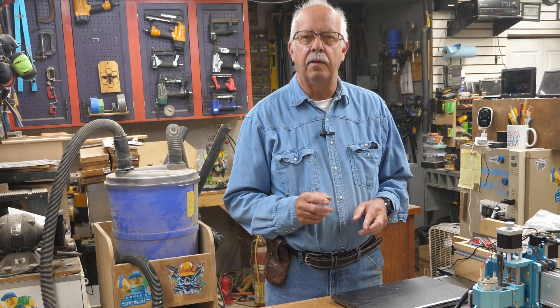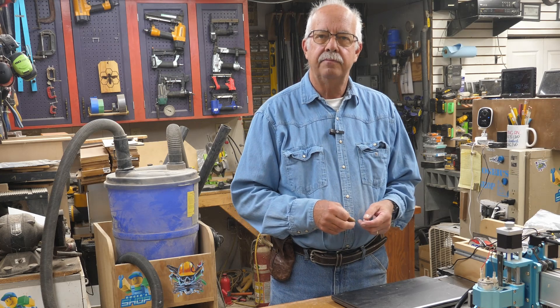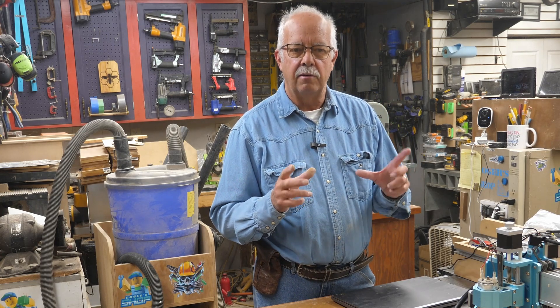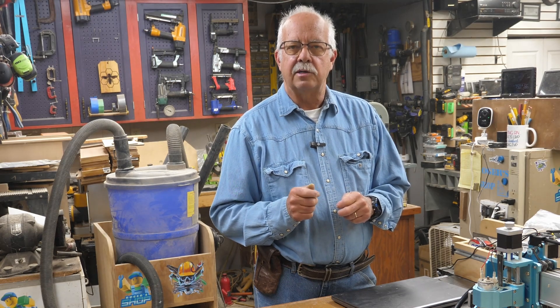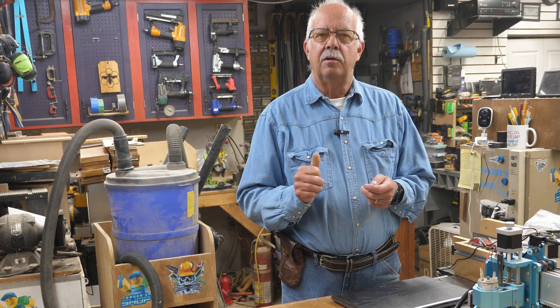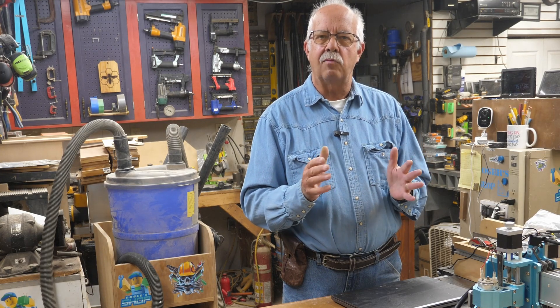Let's talk about time between the three. On the laser, I cut all the back pieces and each one took four minutes. The front with the laser — quarter-inch plywood — that entire cut took 12 minutes. On the scroll saw the front plate took about 30 minutes, and I probably should have taken my time a little more. On the CNC, it took two hours. So the CNC is obviously going to take the longest, the laser is going to be the shortest, and the scroll saw is kind of right there in the middle.